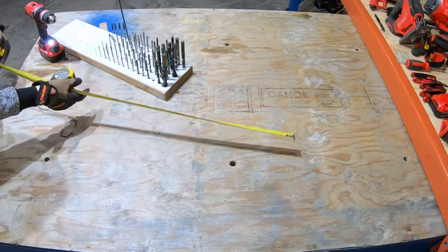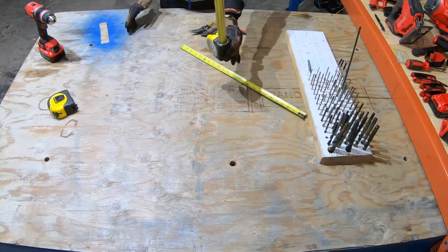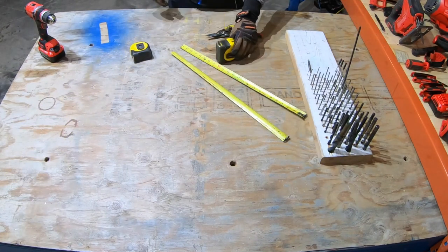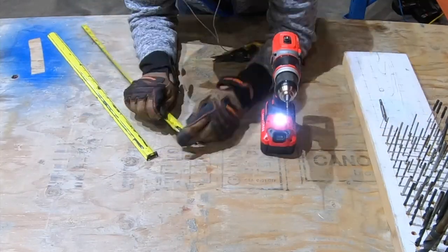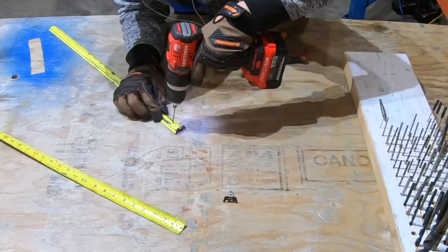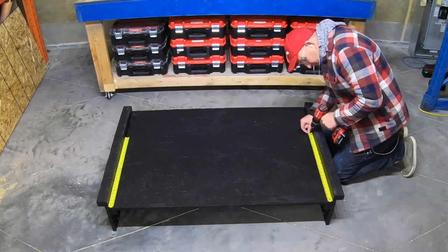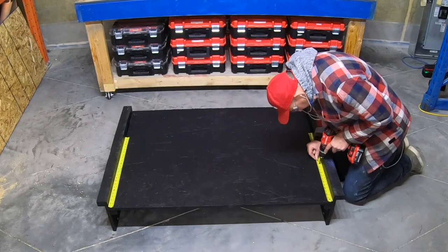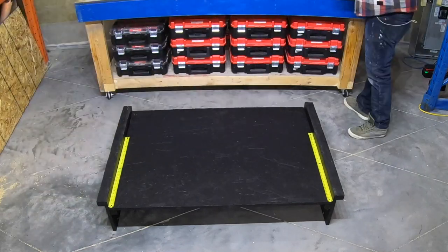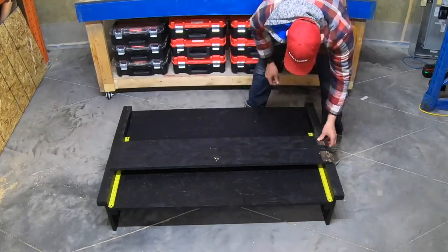Here are 2 old FatMax tape measures, really used to their fullest potential. Now I'm gonna cut them at 24 1/8 inch long and select the right drill bit to screw out the tape measure end. Once I'm done, I'm gonna attach that to my sled for effortless measuring. Mark a 24 inch line from the end of the sled and attach tape measure pieces with wafer screws or pan head screws. Square line up to line up the knife guide.